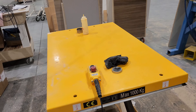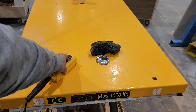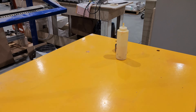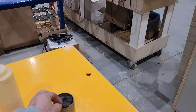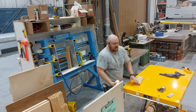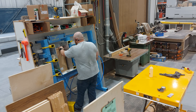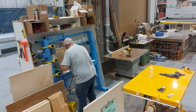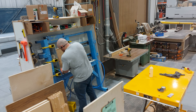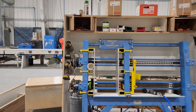As you saw in the other video, we have a dovetail clamp right here where we're producing all the drawers - clamp them, glue them. I have a lift table here to raise and lower, which makes the work height very easy. I keep my bottle of glue here and also a bit more wax for the cut edges, so when the pieces are machined we wax them, and then once they're produced we'll wax them a second coat - that gives them a much better finish.